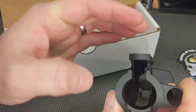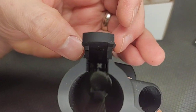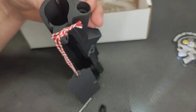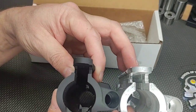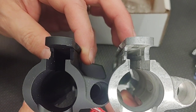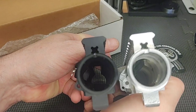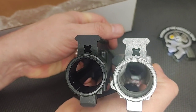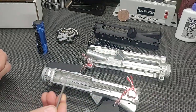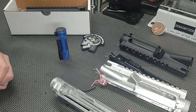So just look for things like cracks and things that look off-centered. Now looking at this one from the back — can you see that this wall looks a little thinner than this wall? But the other example in the white was definitely much worse. Let's do a comparison: it can be hard to see because we have two different colors, but if you look at the front it's pretty obvious — one's centered, one's not. As always, remember these are examples of individual cases. Hope you found this video educational, thanks for watching.